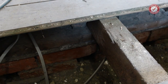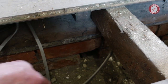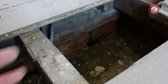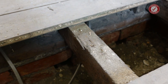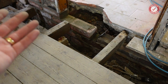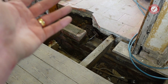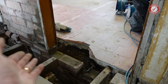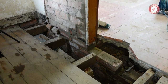And I've checked all around the house, and it's all absolutely fine. You can see we've got nice little ventilation holes underneath the floor all the way along, and that's testament to good ventilation just fixes everything. It's this one floor here that for whatever reason they've done concrete, and I suspect the quarry tiles have been done at a later date and it's just trapped all the moisture under the floor. The moisture's got nowhere to go other than up the walls is my diagnosis